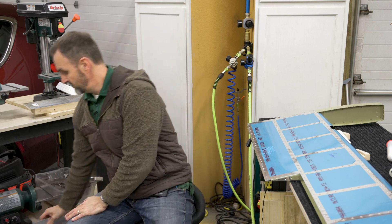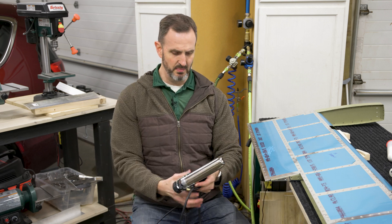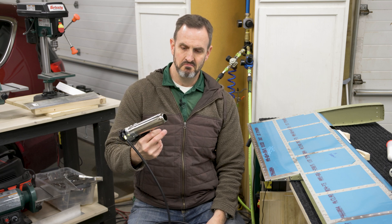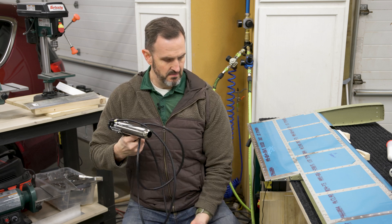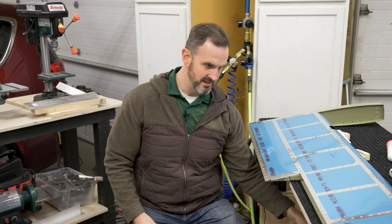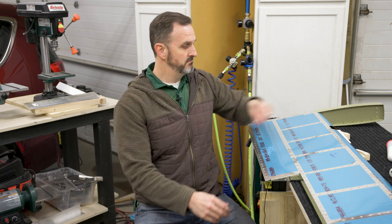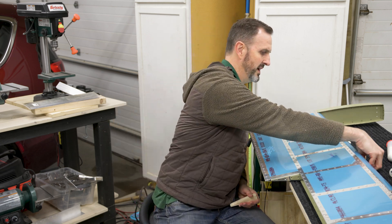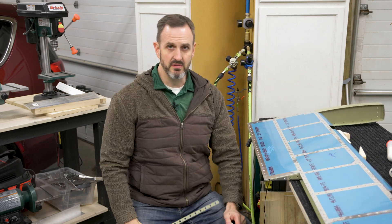When I go to rivet it I won't have any waviness in the trailing edge. Also, I bought this pneumatic squeezer thing that'll help dispense some of this tank sealant and hopefully won't make too much of a mess. So what I'm going to do is put some glue on the wedges, stick them in, get the trailing edge wedge, put some adhesive on that, stick it in there and cleco everything together, then just let it cure for a few days. So let's get to it.